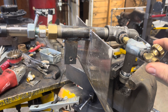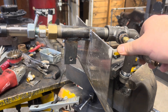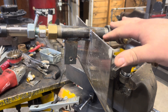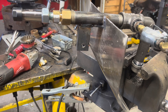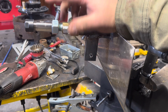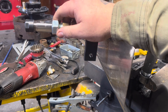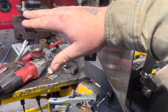Here's the basic overview front to back: I've got an oxygen valve stolen off an old torch, coupled into a little paddle air valve — just like a blowgun valve. Going down, this is just regular black iron pipe, stuff you'd get off the shelf at Menards or Home Depot. There's a little stainless steel shield I bent up — this thing will throw sparks and hot molten slag back at you. Then there's a quarter-inch to five-eighths collet, available on Amazon, coupled to a special drilled bolt and a five-eighths compression fitting.